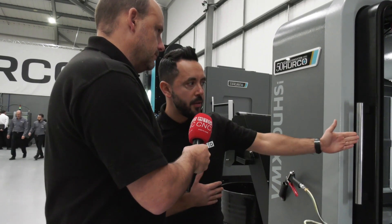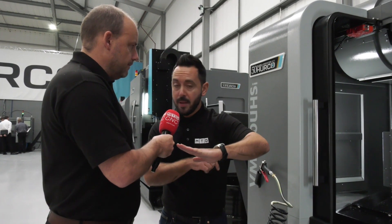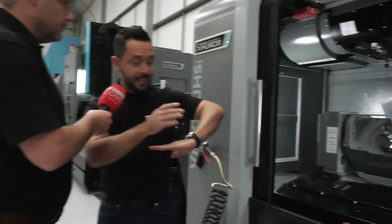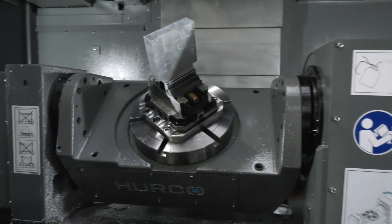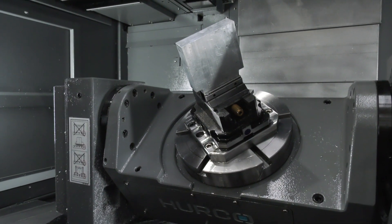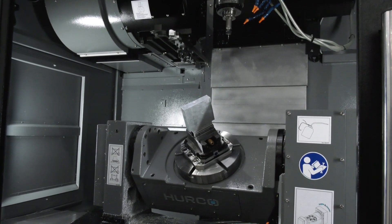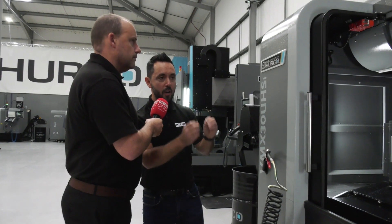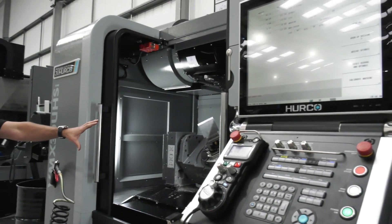It's deceiving, Paul. Really, when you're doing fifth-axis work, 90% of the time your fifth-axis table is at the 90-degree plane so you've got more z-stroke, and you'll be tilting the part around the z-axis that way and then occasionally tipping the part up to get your angular features. You've got enough capacity to do the majority of fifth-axis work you'd like to do. You need to look at this machine and think: if I've got a family of parts of this size and it fits within the envelope of this machine, brilliant.